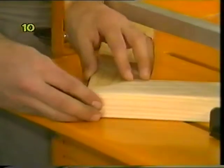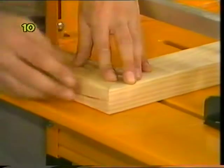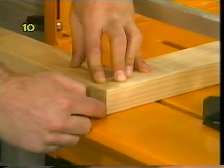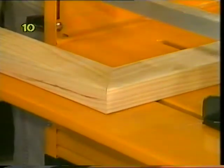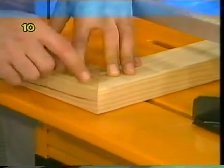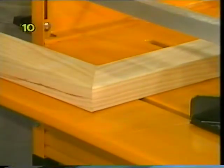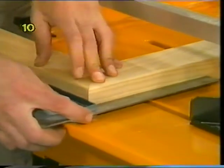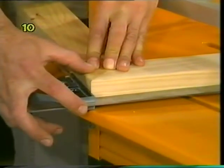Clean any fibres off the pieces and lay them down on a flat surface. Check firstly that there is no gaping — if you've got a chink of light showing through there, then your saw blade angle is incorrect in relation to the table, and you'll need to adjust your wing nut on the front of the saw or adjust your table slightly. If it matches up perfectly, turn your attention to the joint itself. Take a trisquare and take a reading — that's an absolutely perfect 45-degree mitre joint, touching all the way along with no light showing between the wood and the trisquare.